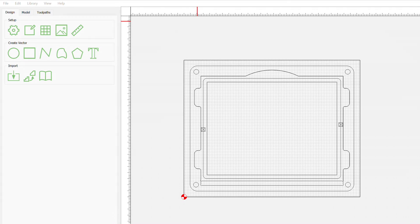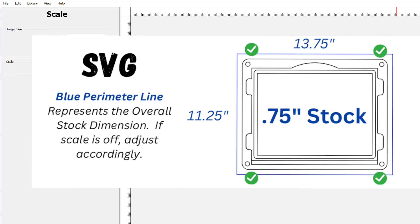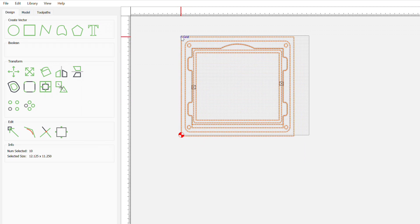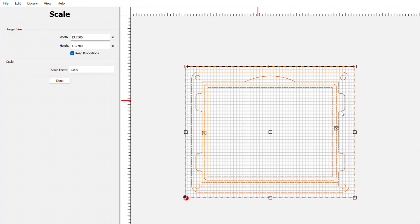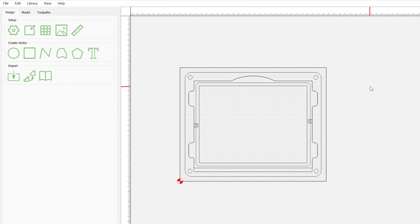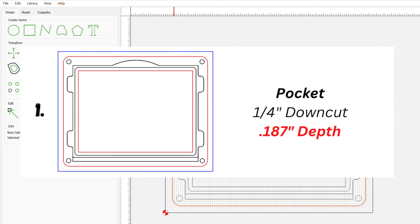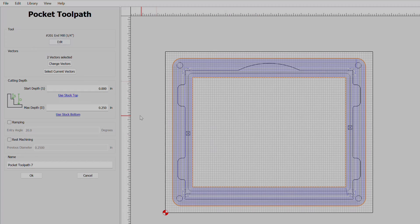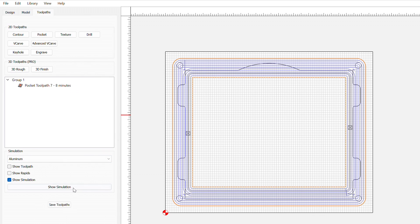To better understand this, let me show you how to apply this within my CAD program, which is Carbide Create. When you import the SVG file into your CAD program of choice, just make sure the outside perimeter edges — highlighted in blue within your build manual — line up with the correct dimensions of your stock material. In this case it's 13.75 inches by 11.25 inches. If this image imports at the wrong scale, you can mess around with it and get it back to its original dimensions. Once everything is scaled correctly, we can look at the first toolpath and highlight the selected vectors shown in red. I'm selecting the quarter inch down cut bit with a pocket toolpath at 0.187 inch depth.